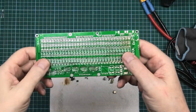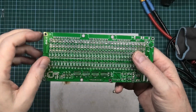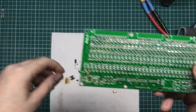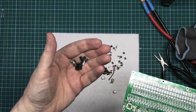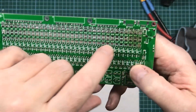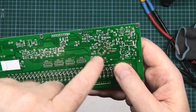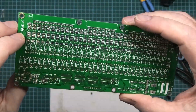This is the main board off an ANT BMS that I've been methodically taking parts off to try and figure out where the problem is. This had a bit of a fire — it was sent to me as a spare. Both processors burnt out, so I've taken them off using my hot air gun, heated it up and wiped them off.